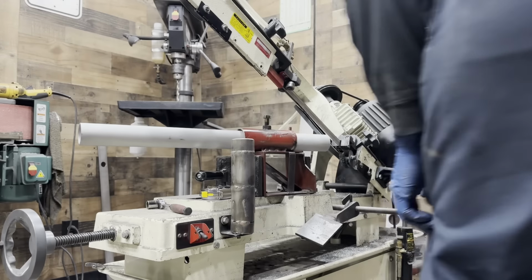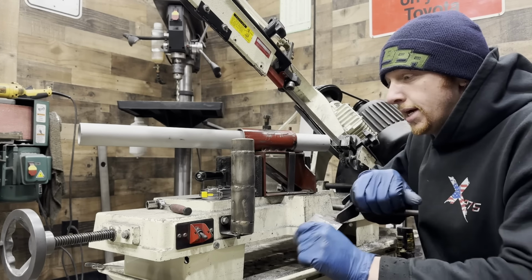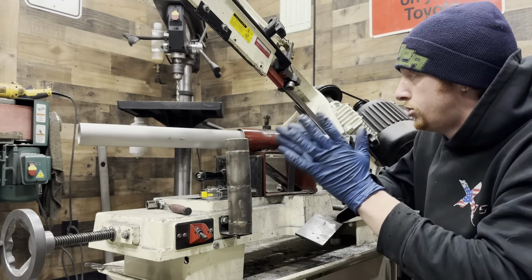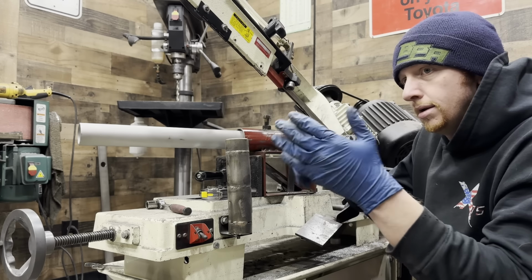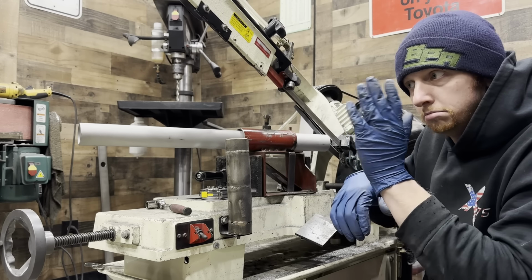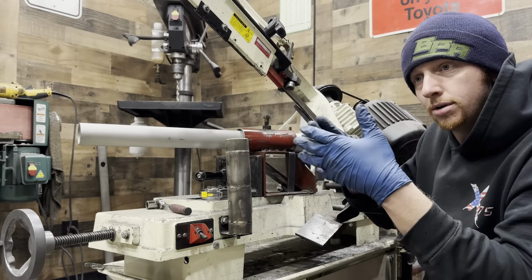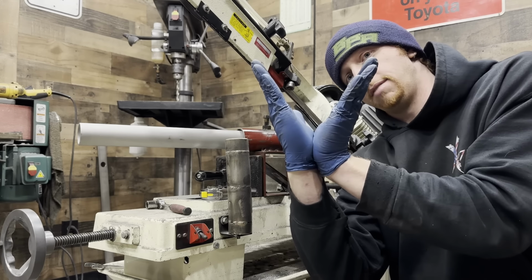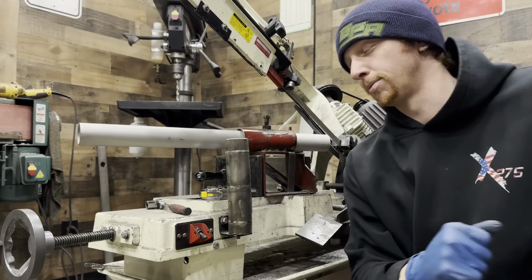Now when you're making 4-cylinder twin scroll manifolds or twin scroll collectors, they're probably about the easiest collectors that you could possibly cut, as there's no rotation in between each of the primary pipes, or each of the pipes for the collector. If you think about it, you're just building two 2-into-1 collectors essentially. So a 2-into-1 collector, you make one cut on one piece, one cut on another piece, and provided that your cuts are even and equal, everything will fit up and you'll have a piece that just kind of looks like a V, just 2 pieces, like I'm mimicking with my hands right here.